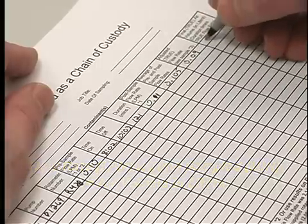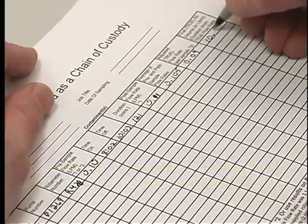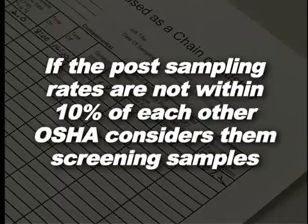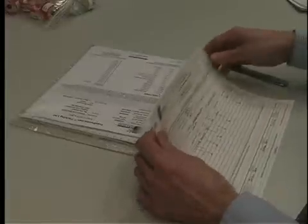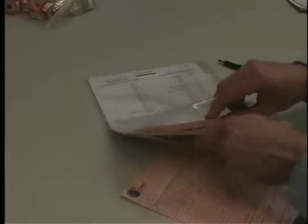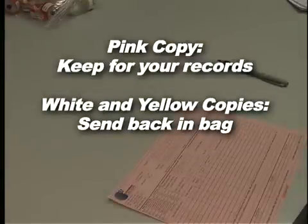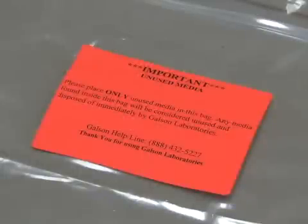Record the total liters on the field pump data sheets and the chain of custody. If the post sampling rates are not within 10%, OSHA considers the samples screening samples, and if the analytical results show high levels, resampling is recommended. Then complete the chain of custody form. It is important that you include all the information requested in order to ensure the turnaround time of your samples. Remove the pink copy and keep this for your records. Send the white and yellow copies in with the samples to the lab in the large Ziploc bag. Please place any unused media inside the Ziploc bag marked with the orange unused media label.